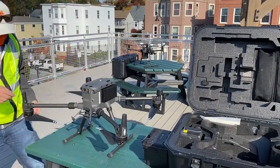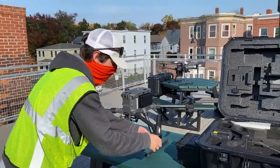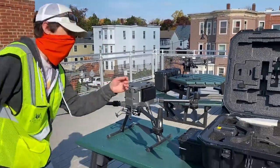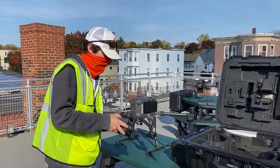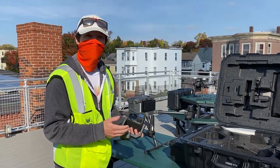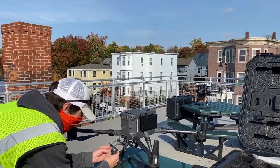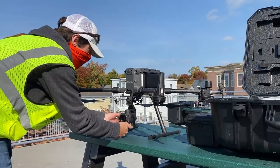These are nice foldable propellers. If you want to take them off you do have to unscrew them with the little Allen key. For today, the very important part for solar inspection is the payload: we have the Zenmuse H20T, which is one of DJI's newest thermal cameras. It has a zoom lens, a wide lens, a 640 by 512 thermal camera, and a laser range finder. I'll slide it on into the SkyPort — pretty easy — and we're ready to go with our payload.